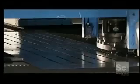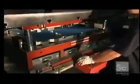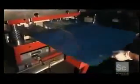Production begins with this computer-guided machine. It cuts out a sheet of galvanized steel to make part of the hood's housing. A 300-ton press then perforates the sheet and cuts out up to 50 openings for screws, wiring, and exhaust outlets.